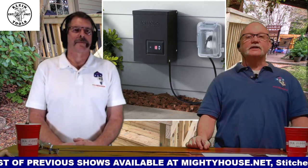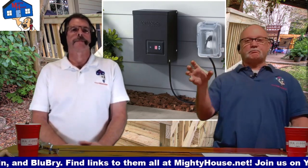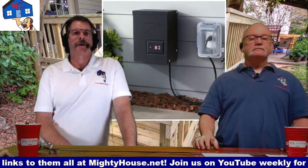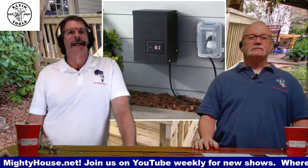And what are they transforming it into? DC — 12 volt DC. Most of them are 12 volt. You might find a larger lighting system where you'd want to go to 24 volt, and if you've got some longer runs you might need to do that. They also make these covers in an accordion style where they lay flat and then accordion out so you can plug them in and still close them. That's what I use on my high-end homes, because most of the time there's never anything plugged into them and people just hate those.